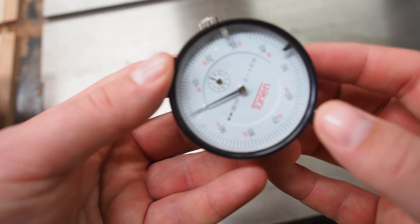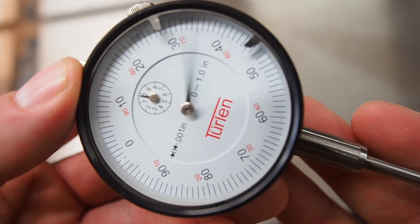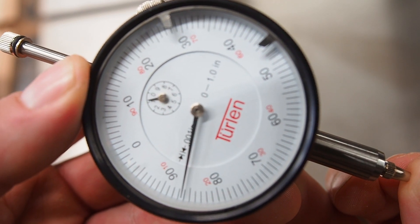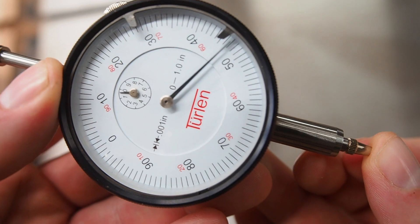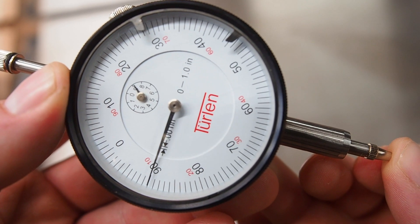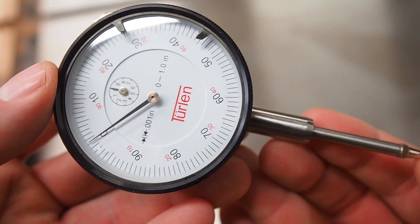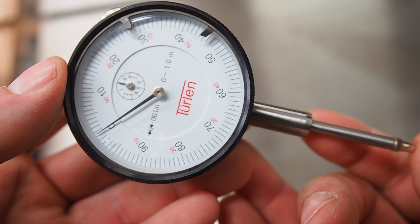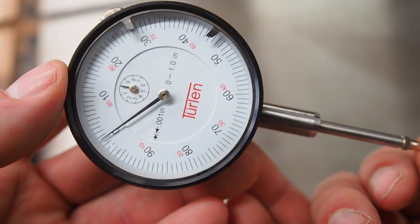This one happens to have an inch of travel — that little gauge goes from zero to nine, technically ten. So if I go all the way in, you're going to see that go all the way around. There's a little bit of extra play for calibration. Based on the position of our probe and the position of that needle, we've gone nine-tenths of an inch. For the most part with your table saw, if you were measuring deviations of greater than a hundredth of an inch, those are some pretty big deviations.